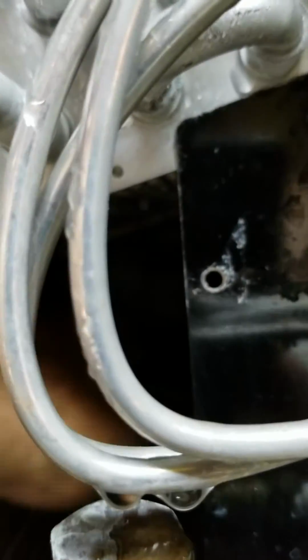Okay, cover's off. There is no ice. I put my hand up here. And it's just waterlogged. So maybe it diminished in airflow upstairs, which is what I did, because the lower vent at the floor is actually taking our cold air and resending it back through the unit, versus being more efficient and taking the air that's higher up. The fins, they're not bad.